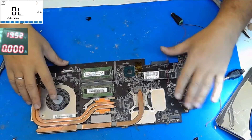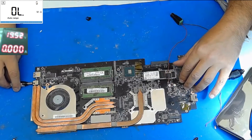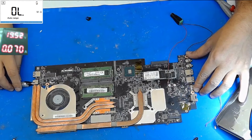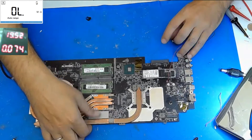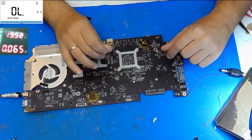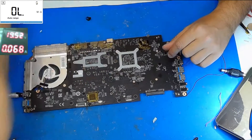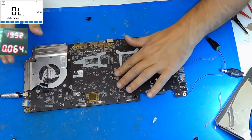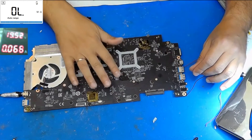This is the board. We have put it off of its chassis and in order to check, we are going to plug our power supply unit. You can see that something is going wrong. This consumption is not very good for a standby circuit. Something is boiling here when I am touching my finger.